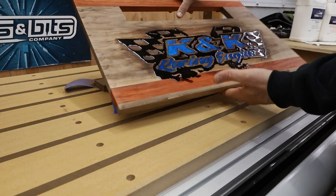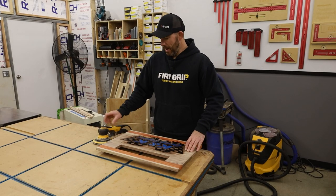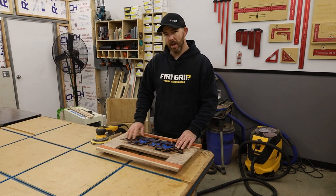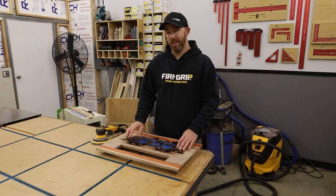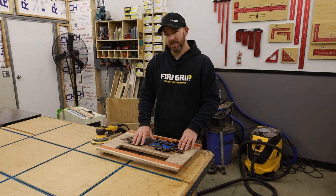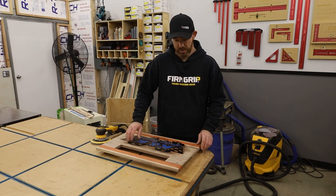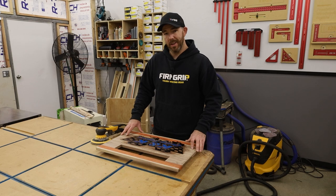I'm going to head out to the other shop now and get this sanded off. I'm going to get some 80 grit on here and get this epoxy sanded down. If I notice it's starting to gum up I'll go a little less aggressive and maybe move a little faster, because the epoxy will heat up and kind of gum and ball up. I also want to get all the machining marks off from the CNC when it was being flattened. Let's get this thing roughed out.